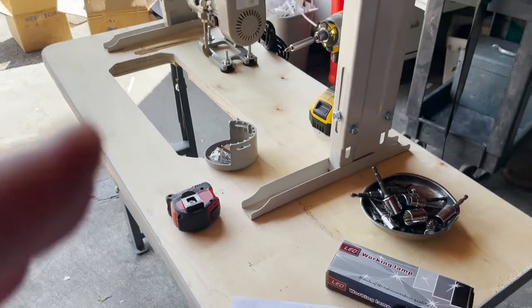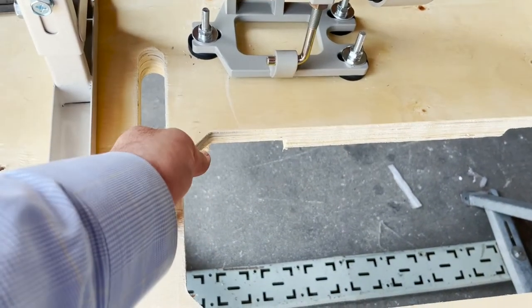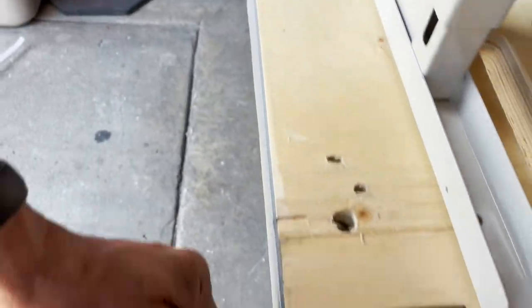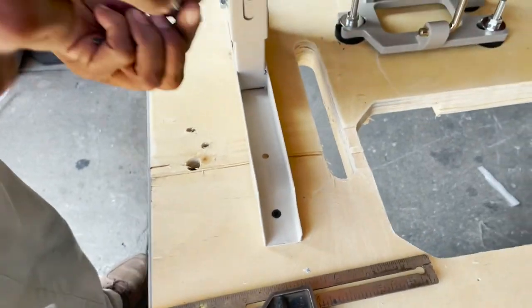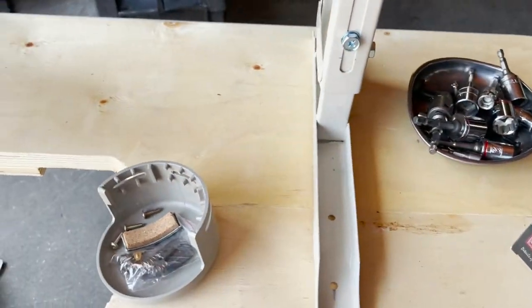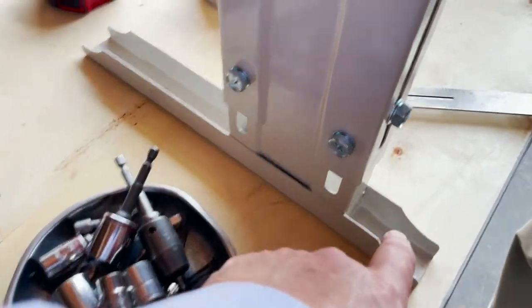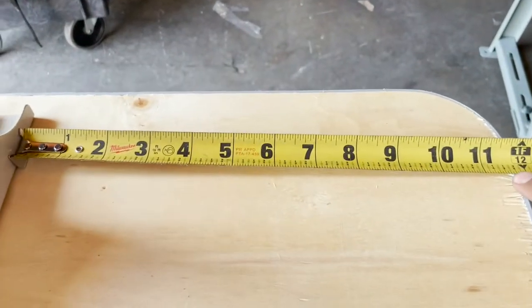You can put the legs anywhere you want, but on this particular sewing machine we have a belt-driven hole here and a motor here. You measure four inches from one side. When you do four inches from one side it will fall here, and then one inch from the side and one inch from the back. There are already holes in there for your screws, and here you will have 11 and three-quarters inches — 11 and three-quarters to be exact.